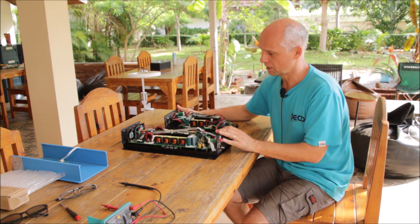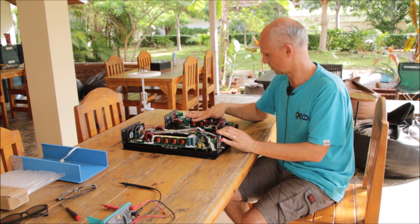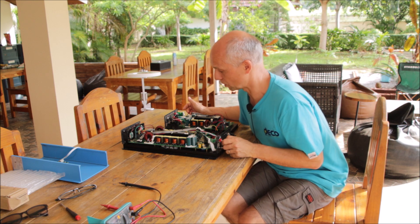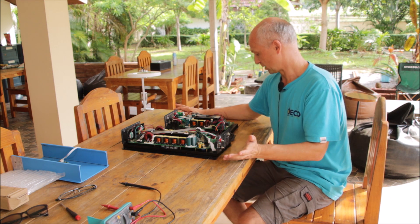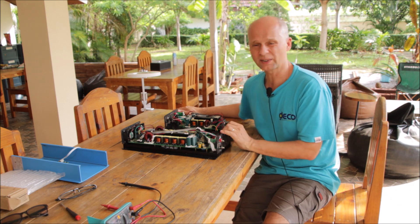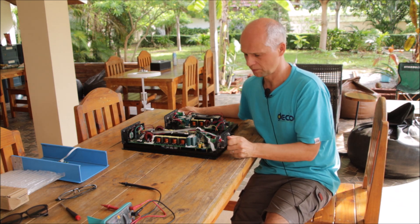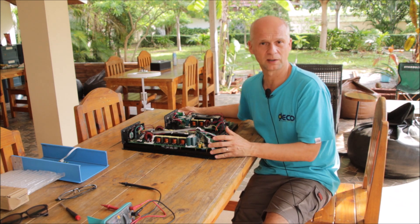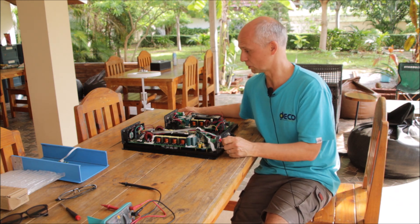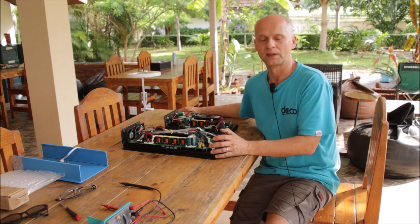What's going to happen with these two inverters? Maybe I'll play around, remove some transistors from the 2000-watt model and put them on the 1000-watt model. If I can find out what kind of gate driver IC this is, sometime I want to try to replace it — but you never know if there's further damage or if it can be successful at all. If you have any idea what kind of inverter could be used instead — a grid-tie inverter able to be powered by a battery with limited output — please let me know. Thank you for watching, please like, comment, and subscribe.